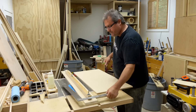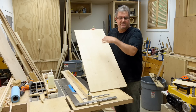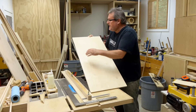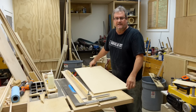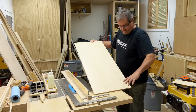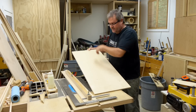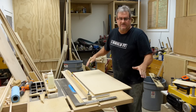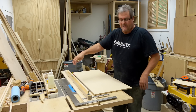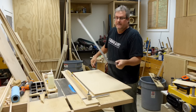I have here the piece of plywood that I ripped the edge off on a taper to show it being used in the video. That didn't square the panel - it actually made the panel out of square. So what I have here is this side with a square factory edge, and the other side tapers this way. To cut this square again, because it's not really that long, I could use the fence on a table saw, but I'm going to demonstrate how to use the square to lay this out square.